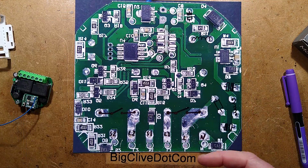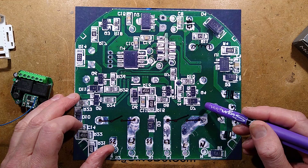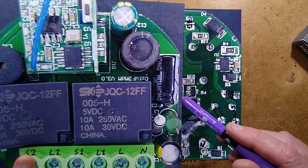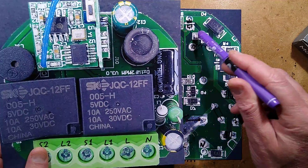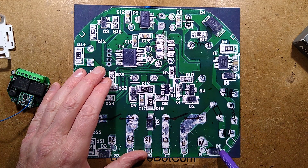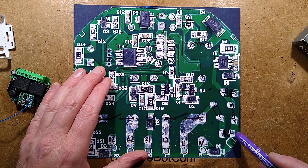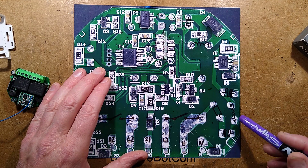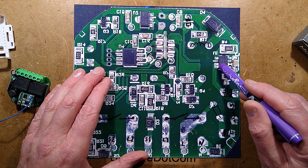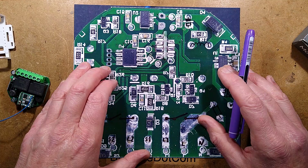Let's take a look at the back of the circuit board - this is where it gets more interesting. The image is flipped so it tallies up with the other image. They've skimped on the power supply: they've got a single diode, not a full bridge rectifier. That single diode charges this capacitor up with live coming via a fusible resistor. So this capacitor charges to peak mains voltage. There's an inductor for filtering and then another capacitor, which also charges to peak mains voltage, and then there's a little switch-mode chip. It's a buck regulator, so it's not isolated from the mains. This is where the electric shock came from.